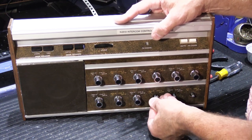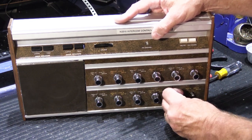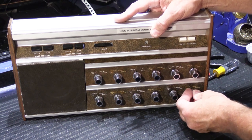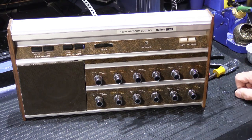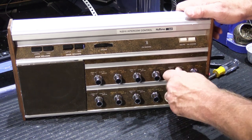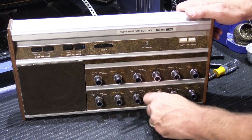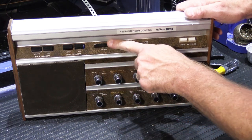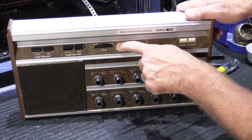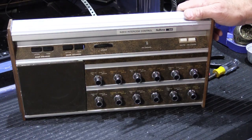However, you know about the secret spoon trick now, so you can be the envy of all of your friends who have stereos with stuck knobs. And like that. So here's our cleaned 2510. Our switches have all been cleaned. They all work well. We cleaned our volume control. It rotates freely. There's no drag and it doesn't rub on the cutout. We cleaned our plunger switches, and that's it.